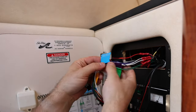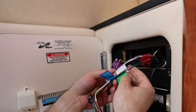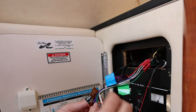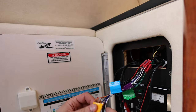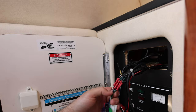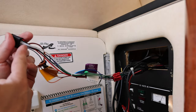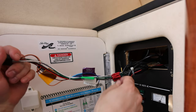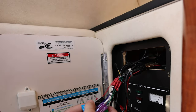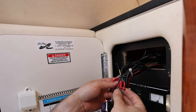I'm going to unplug this so I can go through it more easily. As you can see, these are all labeled — amplifier out, power, ground, zone two, various speakers, telemute, which I believe mutes audio when you get a phone call, and a regulatory label. On your old radio, you're going to have to cut the wires off that are going to the connector. Leave some wire remaining so you don't cut right up against the connector — that gives you as much wire as possible. You can pull up the manual for your old radio to figure out exactly which wire does what.